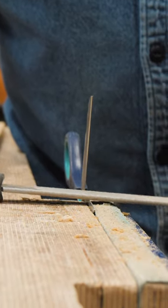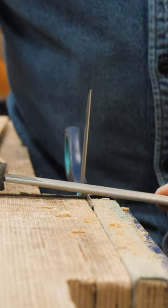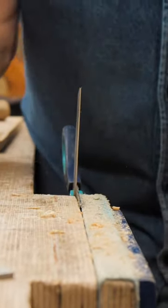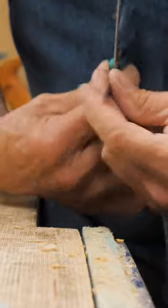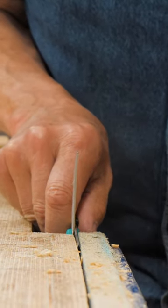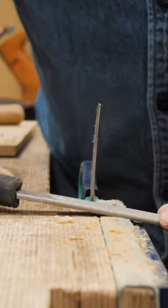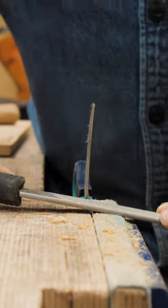You put your file — this is just a flat file, a 10-inch flat file — and move it forward like that in one continuous stroke. That has cut an edge onto the scissors on that side. Do the same on this one. Two or three strokes usually does it.